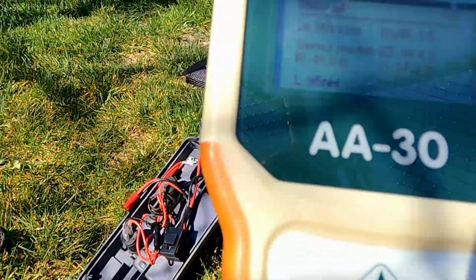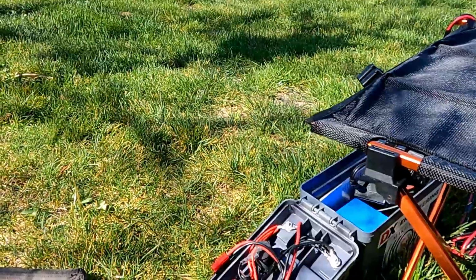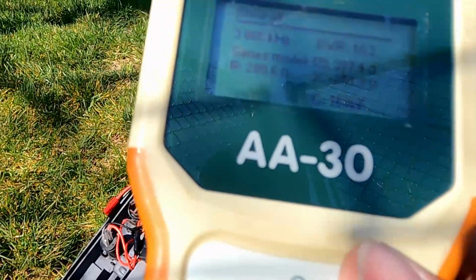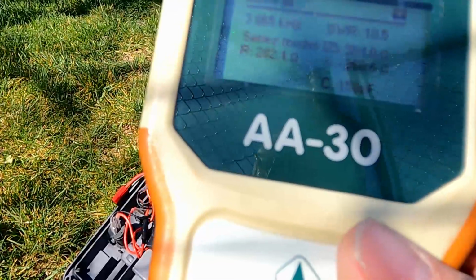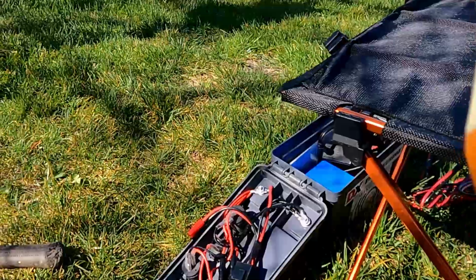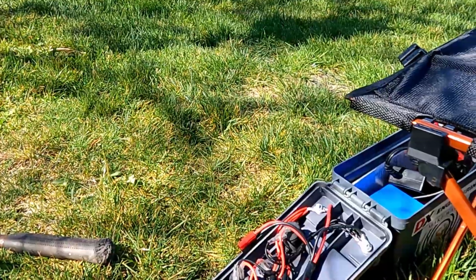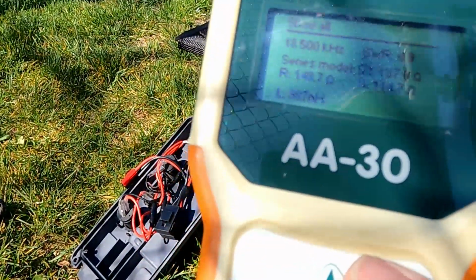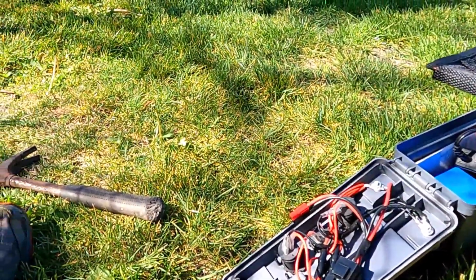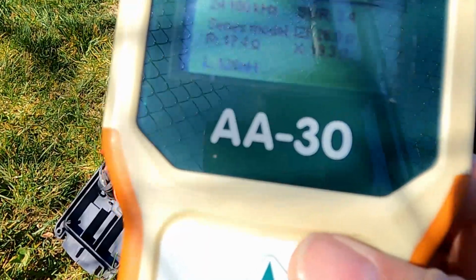Yeah, this thing's, let's see, let's just try. There's 3.865. Yeah, but it's not made for 80, so I could tune that with a decent manual tuner or a good aftermarket tuner. Should pretty much handle that or get it within reason. Let's try 18.500. Yeah, 4.9 on 18.5. Let's try 24.00. Yeah, 3.3. I think I'm going to leave it where it's at.